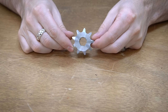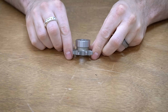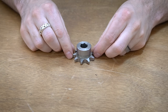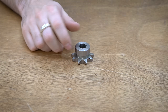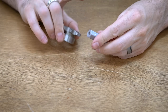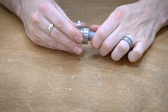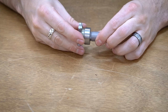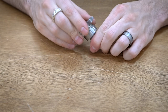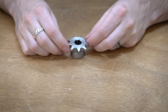And here is the finished sprocket — we've got a nice hex bore on it. On the back side there's a little bit of squish-out, kind of split out a little, so there are some burrs there that I just need to knock down with some sandpaper. I 3D printed a hex shaft to test the fit since I don't have any hex shafts in the shop, and it's almost exactly half an inch. It fits in loose but there is just no slip or play whatsoever, which is really cool — a pretty good fit.